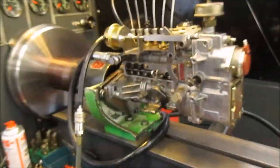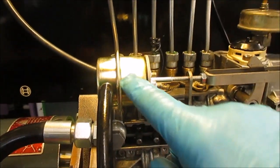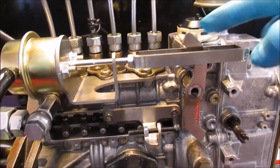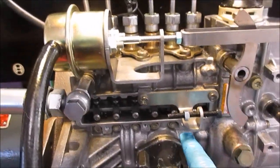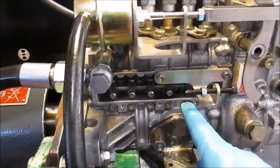Then we have the new one — basically the same thing. You have the wastegate valve up here, the stop lever here, and the maximum adjusting there. What I've done here is take away the cover so you can see what's happening.